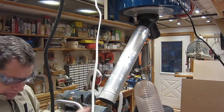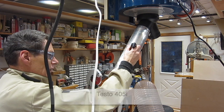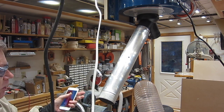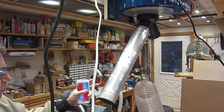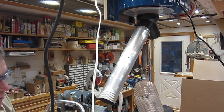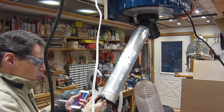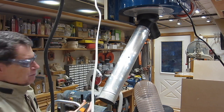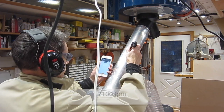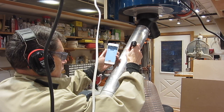Here's my velocity measuring instrument. It's a nominal four-inch diameter duct. I stick this velocity meter in and can go to different depths, then read out the velocity on a smartphone. A good velocity is 4,000 feet per minute — that keeps ducts clean regardless of duct size. 4,000 feet per minute in a four-inch duct works out to 350 cubic feet per minute, which is what most table saws recommend. For comparative readings I take the reading from the same position at the center. I'm getting 7,100 feet per minute with no filter and no other ducting, so I'll only go downhill from there as I add more parts.